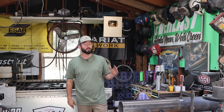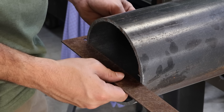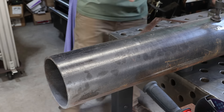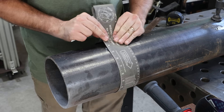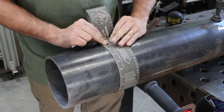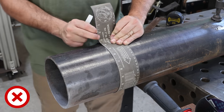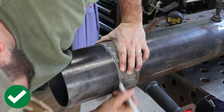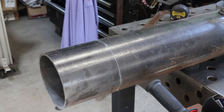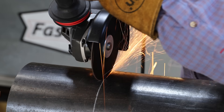Let's talk about the cutoff wheel and cutting our coupons to size. First, we need to check if the end of the pipe is square — just take a square and make sure it's nice and flush. Then pull your measurement for however long you want your pipe pup to be, and then use a pipe wrap. Make sure there's a lot of tension on it — I've seen guys use a pinch method and miss the top. I prefer having it really overlapped and tight.